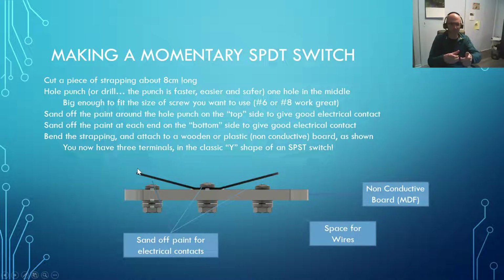You want to think about how big your hand is and think about ergonomic fit. So you're going to be holding the controller in your hand like this. You don't want them to be too long, because if they're too long, then you've got to move your thumb back and forth and you can't control your robot quite as quickly. But you don't want them to be too short, because if they're too short, then you have to push really hard in order to get the movement to go down and touch the screws, because you've got to move them through a big angle right down here. So this is just some guidelines for getting started. I'll show you some pictures of some fancy ones that students have built later on.